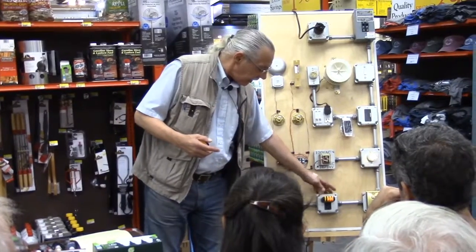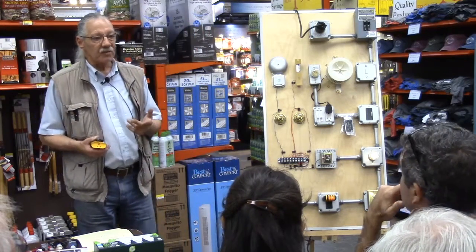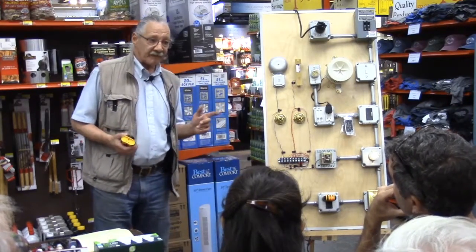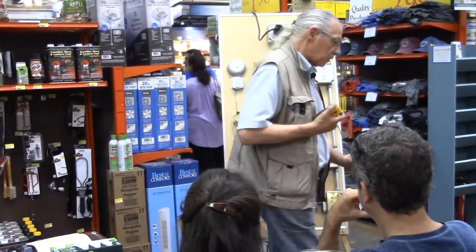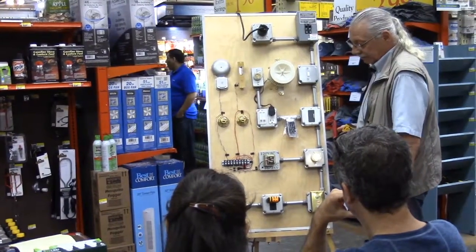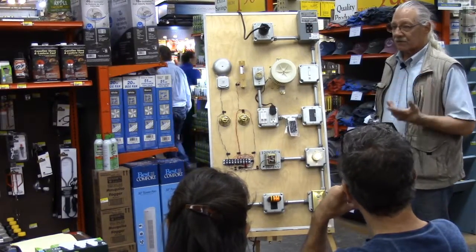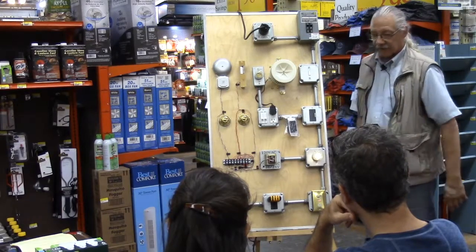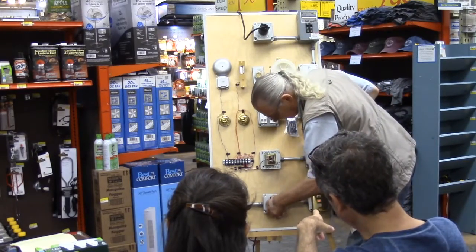In cases of GFIs — the new ones, within the last four years — the new ones will not work if they're wired backwards. The old ones would, but the new ones will not. So normally if you're testing GFIs, you don't have to worry. This is also a tester in its own right. If I wanted to test the GFI to make sure it works at a certain threshold of voltage leakage, I just pressed the button and it just tested that GFI — turned it off. And the GFI is back on.